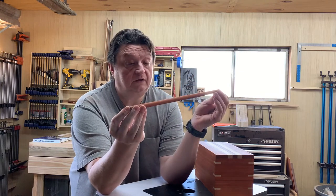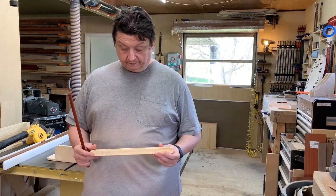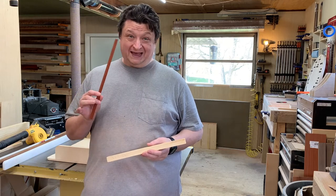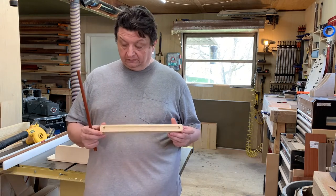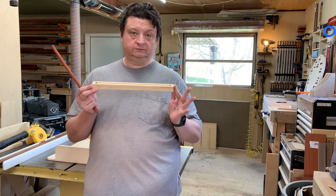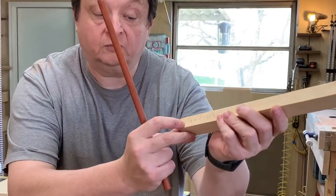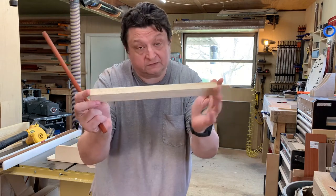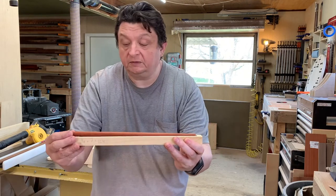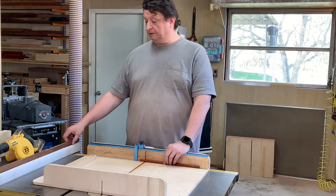That's the next step. We're going to take this now to the table saw and we are going to hack it to bits. I had to find a way to stay organized with this process so that this goes back together like it comes apart. And so one of the things I did, I just made a simple little thing, just something to hold this in, kind of like a Scrabble piece holder. We look here, you can see I even have the maths worked out so I don't forget. We're doing 7 pieces at 1¾ inches, makes us 12¼ because all my boxes are 1 foot unless I'm making something custom. The pieces will sit in here as I cut them and I'll keep them in order. So I'm going to start cutting this into pieces. All right. So let's get this thing cut.